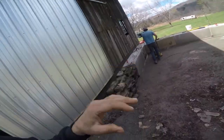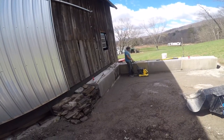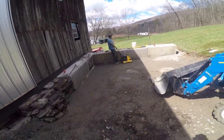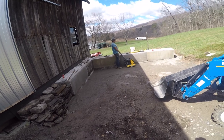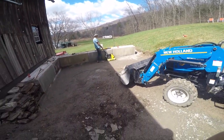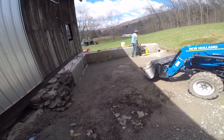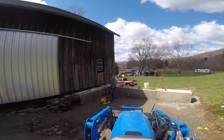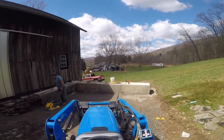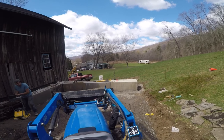That's what I'm thinking. So, we got the wall all up. Even after our broken hose, now we have to bring up fill. So we're doing pea gravel here, now we're gonna bring up modified, just keep tamping it in. Get the whole thing leveled out and make it so it drains and so water can't really penetrate through the modified. That's our plan anyway. You ready, Freddy? You ready? Oh, you gotta put it in gear.